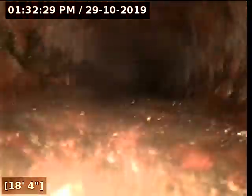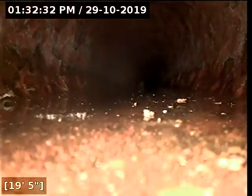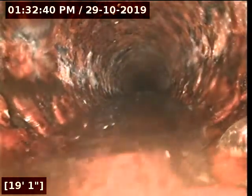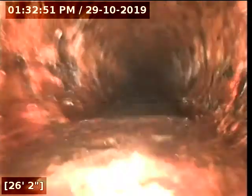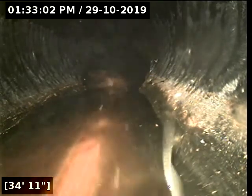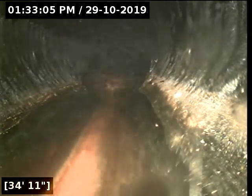And there's our turn — turns. You can see that the side walls of the cast iron are deteriorating, but are still serviceable. There's another turn, and another. This is good here, although I'm seeing maybe a possible belly. This is a transition from cast iron to newer ABS.